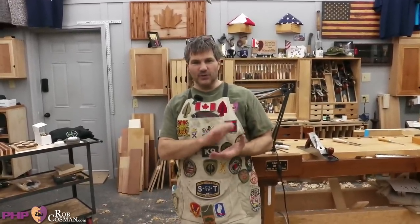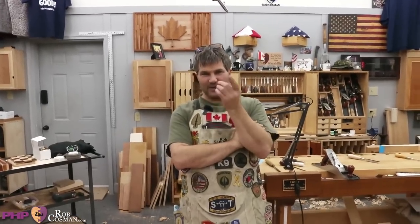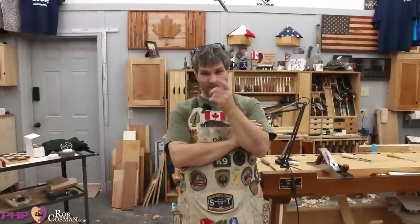He said, what's the difference between making a tertiary bevel on the 10K Shapton versus the 16K Shapton? No difference. The only difference is the level of sharpness. Your tertiary bevel is done on your final stone, whichever it is, whether it's 8,000, 6,000, 10,000, 16,000, 32,000, whatever. It's all done the same way. You're going to get a better edge off of the 16 just because it's finer, same as my analogy with sandpaper, sanding to 120 grit versus 320 grit.